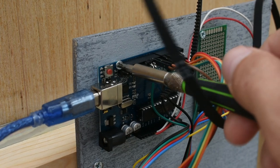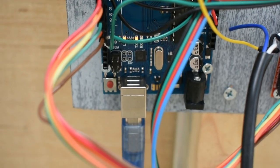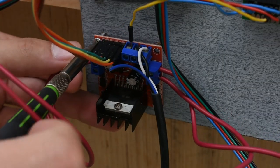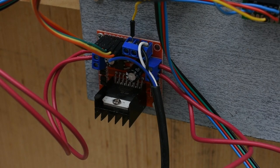All the positional data and predictions are then sent to an Arduino Uno over serial. The Arduino uses this data to decide which direction it should move the motors to translate the board up, down, left, or right, or a combination of both. It then sends signals to a DC motor controller, which provides power to the motors to actually translate the top surface of the board.